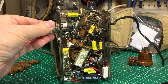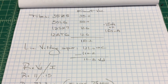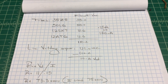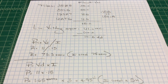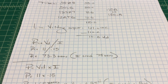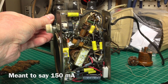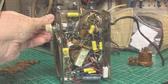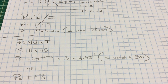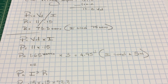If you add up the four tubes it comes to 110 volts needed to power the radio, and since modern-day power is at 121 volts, you do the voltage drop calculation: 121 minus 110 gives you 11 volts. We know the particular tubes in here draw 0.15 amps or 150 milliamps. So you take the voltage drop of 11 volts, divide by 0.15, and it gives you 73 ohms — which is why I stuck a 75 ohm resistor in.